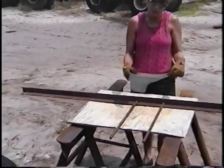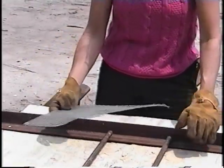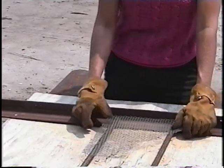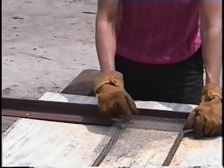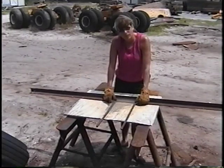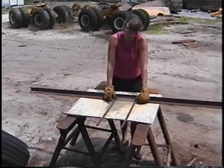The third application is the galvanized lath. Once these welds are made and you've determined your shape, you will apply your galvanized lath and tie it off with galvanized tie wire, upon which you will then place the 1/4 inch scratch coat that will stiffen this cage and allow you to then move into your final plastering.